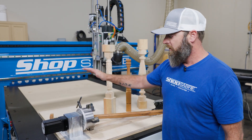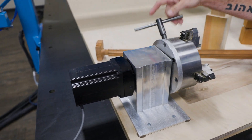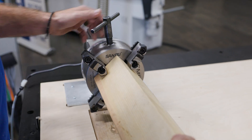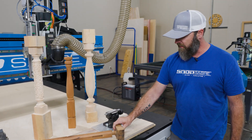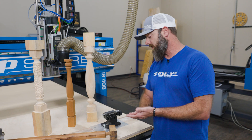Let's talk about the hardware we've got here. There's an industrial motor that plugs right in. We can turn the jaws, spin them — they're going to tighten evenly, and we can also reverse them based on the stock size we're using. We've got an adjustable tail stock that adjusts up and down and in and out so we can precisely get exactly what we need.